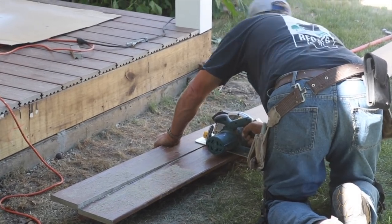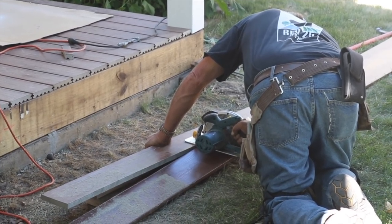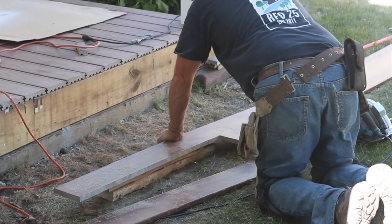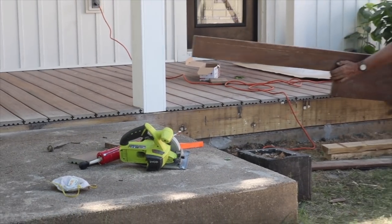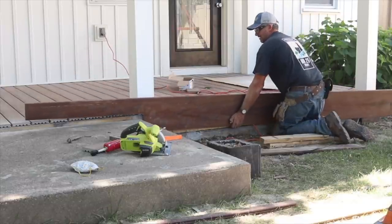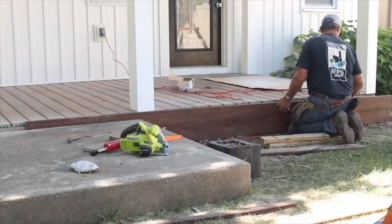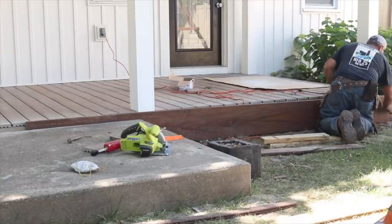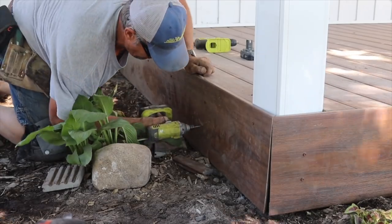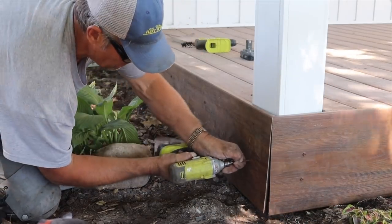This piece needed to get notched out of the 11.5 inch wide fascia board to go along the front and then go behind the cement step that we had going on to get onto the porch. The edges of each fascia board are completely finished, so we made it so that they just rise up and cover the ends of each of the cut boards that lay the actual floor. The ends of the fascia we mitered so that the corners meet up and cover the cut ends. So the fascia board just gets screwed in — it doesn't have any fancy turbo clips into the joist system with composite decking screws.